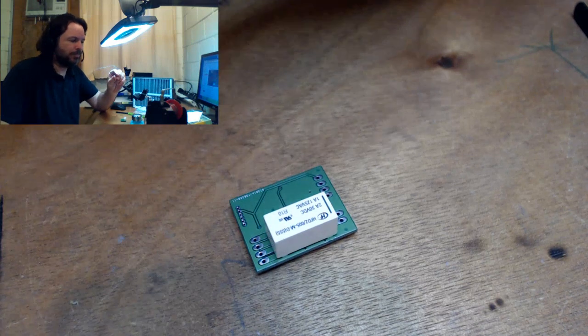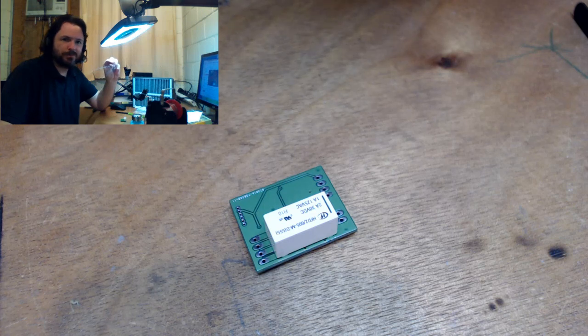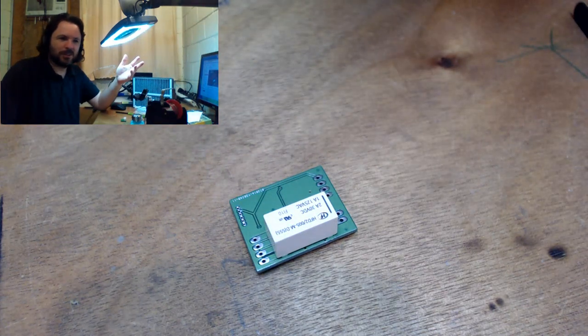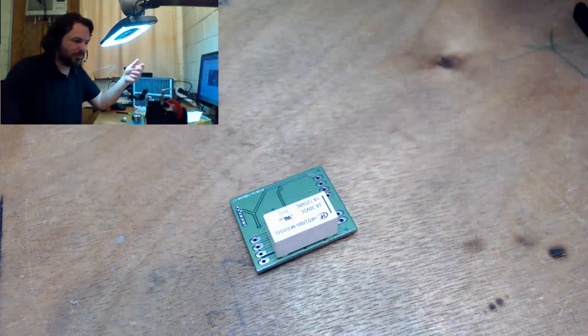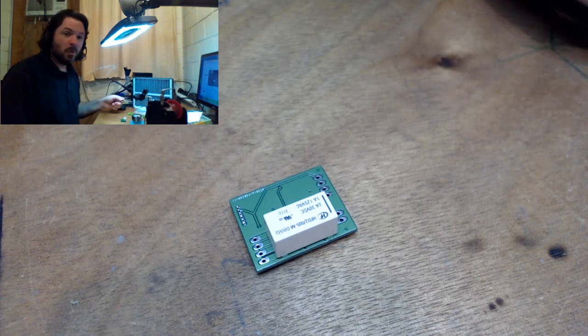The variant they've given me is about 1 millimeter shorter, and because of that 1 millimeter shorter aspect, instead of getting 92 dB out of it, I was only getting 82 dB, and it was completely useless for the product that I was manufacturing, because it was a lost model aircraft alarm, and so you wanted 92 dB or even better if you could. And these 82 dB type things, it was just useless. So I've had that reel there as a reminder to me to be more cautious.